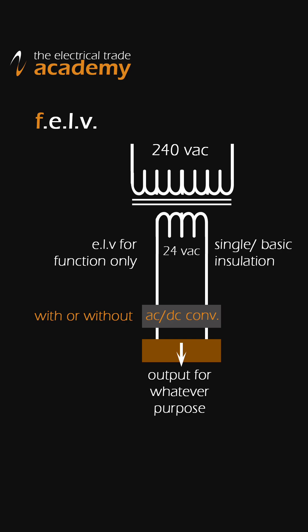Lastly, FELV stands for Functional Extra Low Voltage. You can think of it as the old-school ELV used before modern standards came along. Electrical devices and circuits are powered from a simple transformer tap with outputs that are not isolated from the mains and have no inherent shock protection. Safety relied entirely on the insulation and the enclosure, and as for earthing, that may or may not be present. The big downside of this arrangement is that a single fault could dump full mains potential on the supposedly extra low voltage side, which is why the industry moved to SELV and PELV.